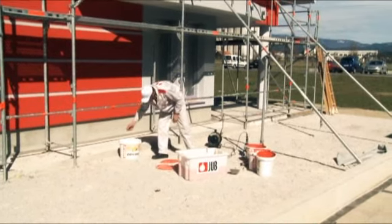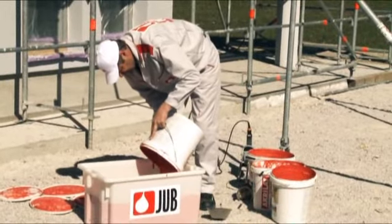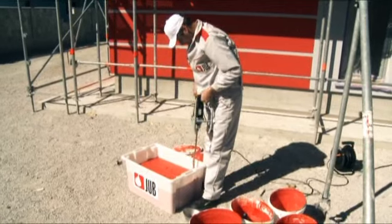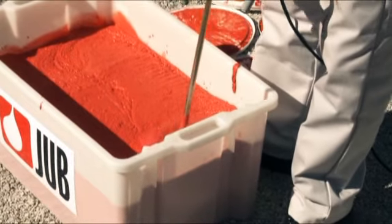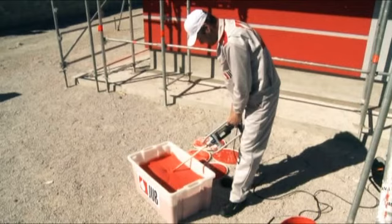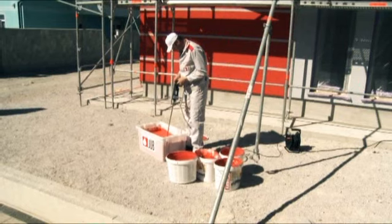The colour shade must be checked, and then the mortar compound should be equalized to remove even the slightest, even imperceptible differences between individual containers. First, mix the content of 4 containers in a bucket of appropriate size. Equalization of white mortars of the same production batch or having the same manufacturing date and which have not been diluted is not necessary. When stirring paste-like mortar compounds, care should be taken. Stop stirring when they become homogeneous.